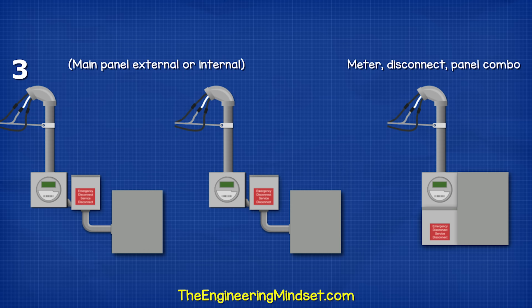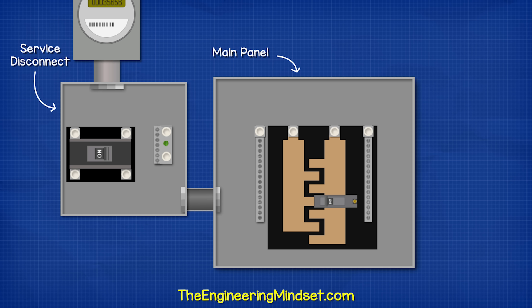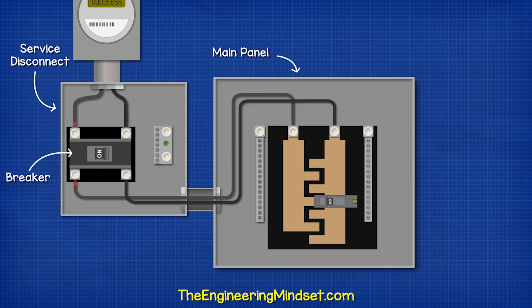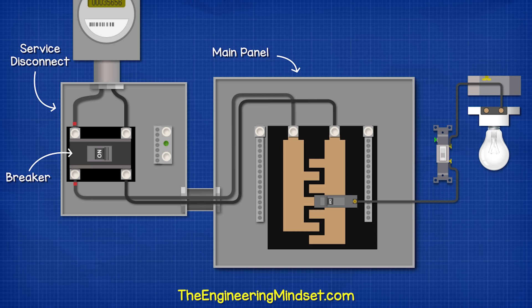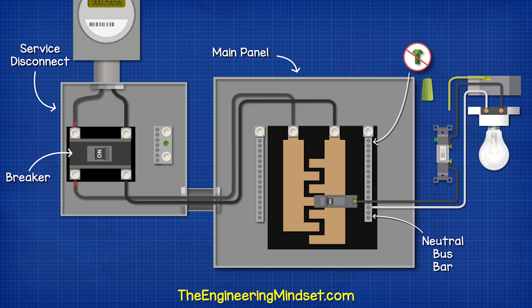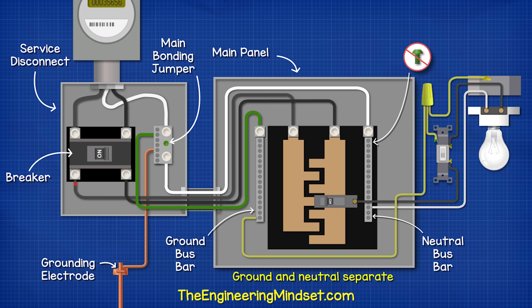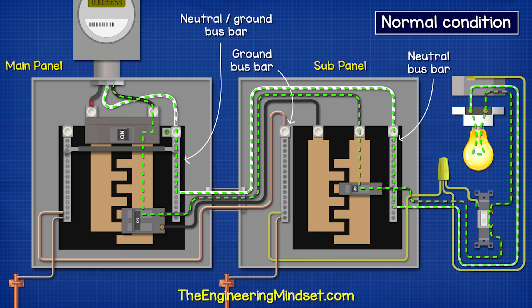However, scenario three is different. The service hot wires connect to the main breaker, then to the hot bus bar lugs in the main panel — there may or may not be an additional disconnect here. The hot wire goes to the load, but the neutral comes back to a separate neutral bus bar which is not bonded to the metal case. The ground wire also comes back to a separate bus bar. Both the neutral and ground travel back to the main disconnect box and connect to the same bus bar — this is where we find the main bonding jumper. The service neutral connects here also and we find a connection going down to the grounding electrode. The ground and the neutral do not connect in the main panel — same as with a subpanel, which we'll look at in just a moment.